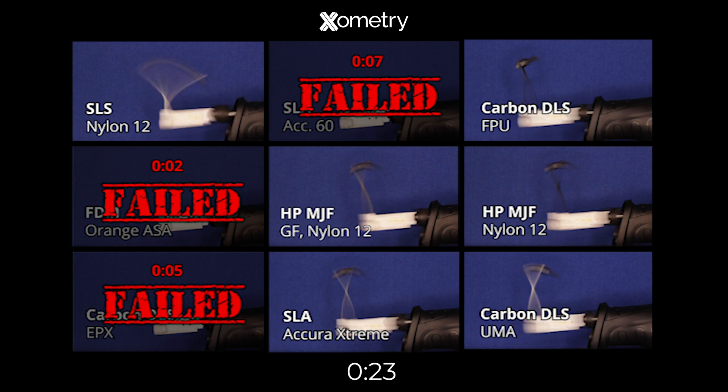What's interesting about this test is all these parts are going to find their resonance — the difference between how the part is flexing, based on its actual flexural modulus, and the movement of the sawzall. They'll find that at different times, and probably the most violent movements happen when the sawzall is warming up. The start and stop is actually probably the most violent flex movement.